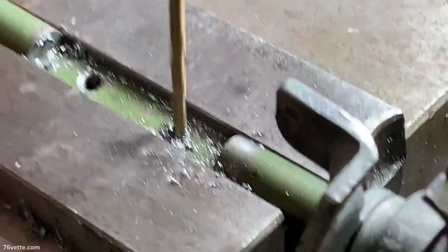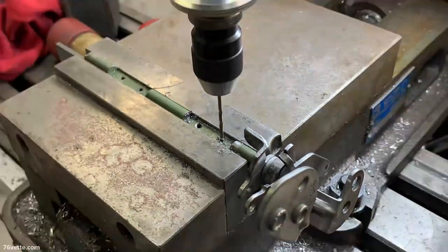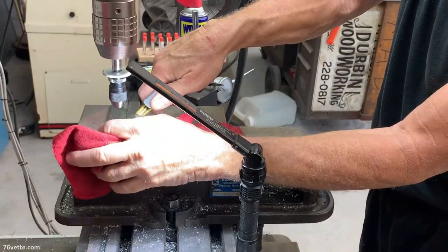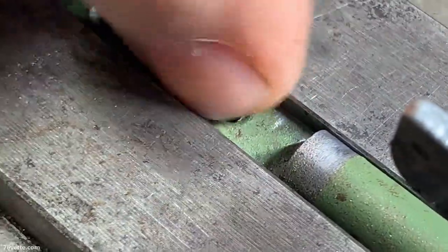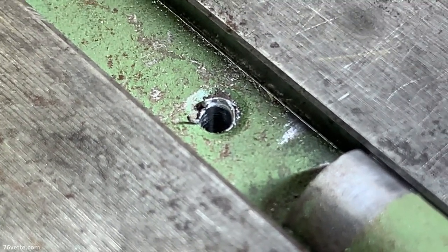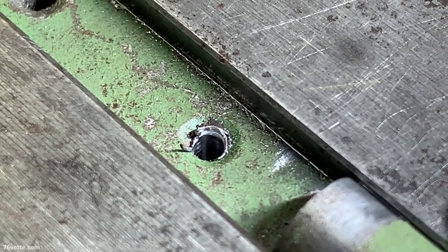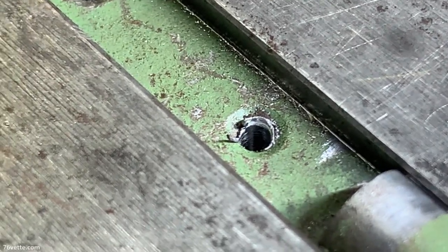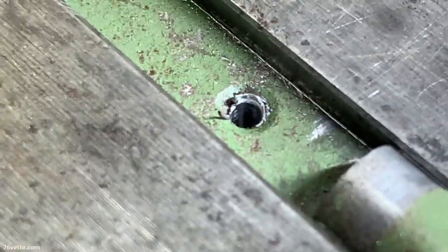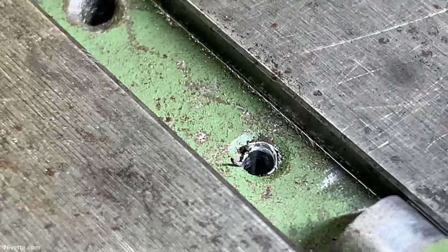Should be about through — we're through! This is probably going to crack a little bit. I put a lot of pressure on it; it felt like it might have cracked, but I'm not sure. It should be ready to peel out of there — seems to be. If you can lift that edge there, it'll come right out. Can you zoom in on that? I can almost see the threads in there. That's what we want — you should be able to see the root of the threads, and you should be able to see them all the way around the hole if I'm centered. If you can lift that little edge, then just peel it out. It may come out in one piece — that's what I'm hoping. A lot of times it will, if everything's perfect.